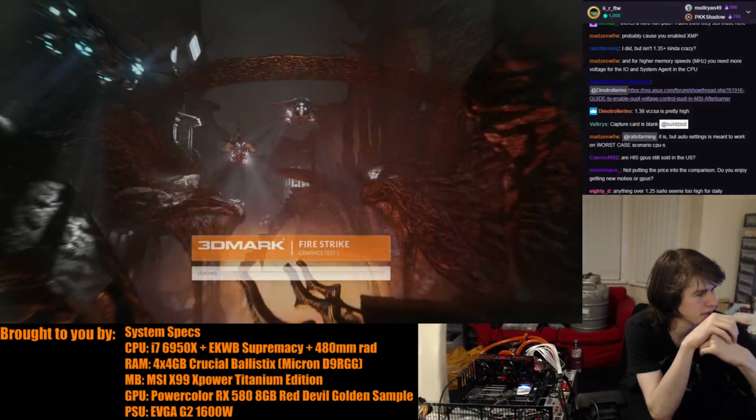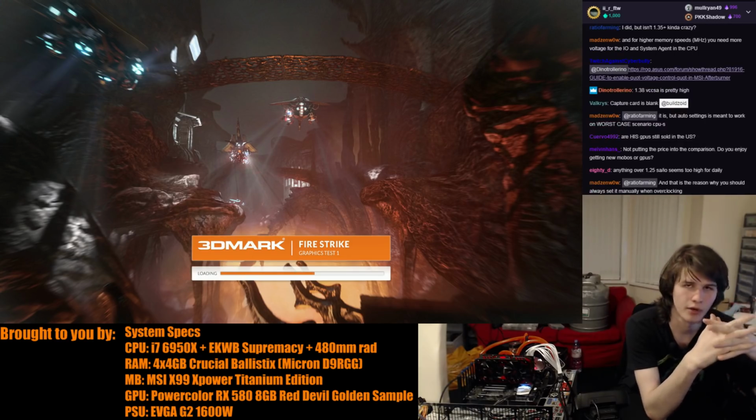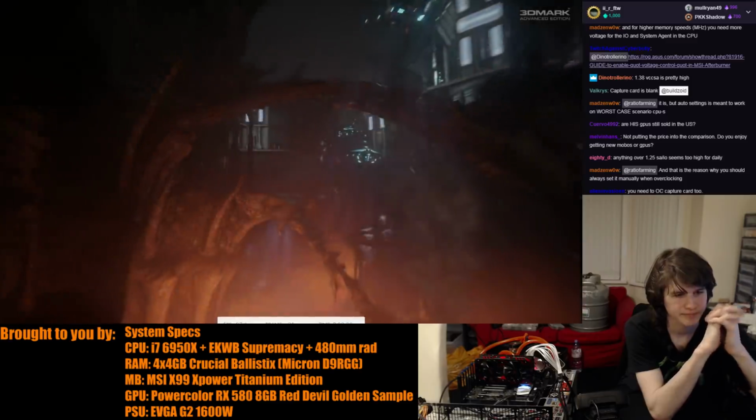I wouldn't go over 1.2 for Skylake, Kaby Lake, Coffee Lake. I wouldn't go over 1.3 volts on system agent or IO. So, yeah. Just gonna throw that out there.